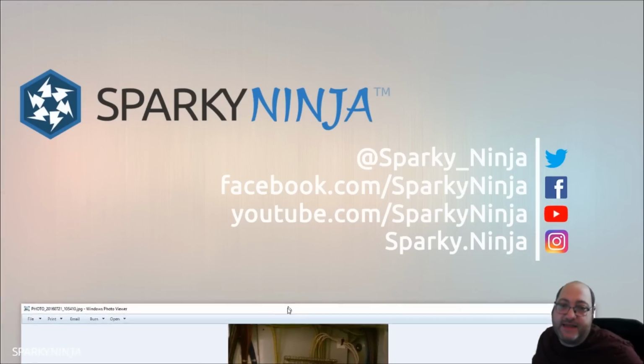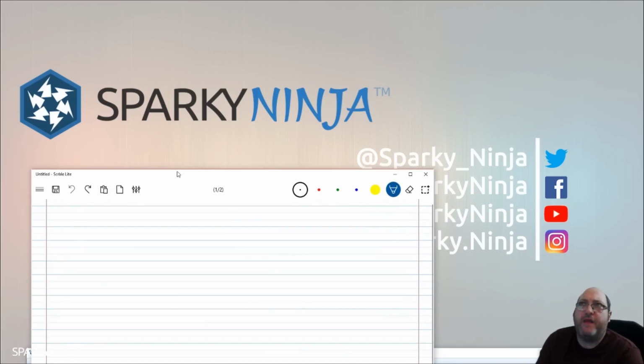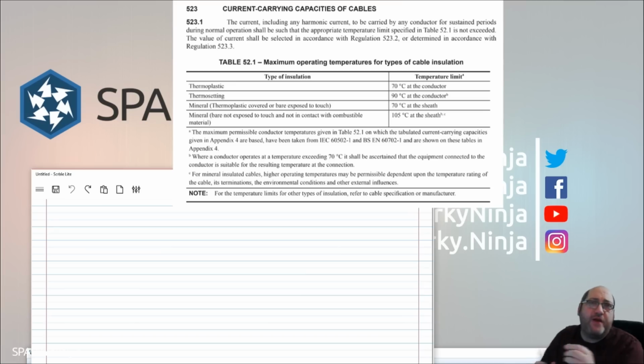Well, first thing we need to understand is the capacities for conductors. So if we were to assume that these cables were the standard off-the-shelf 70-degree thermoplastic, we need to remember that 70 degrees is the limit operating temperature for those conductors. We have a regulation that tells us this. Is it this one? Yep, 523.1. This tells us about the limiting temperature at the conductor for thermoplastic insulation, 70 degrees. So when we say a cable can carry X amount of current, what we're really saying is it can carry that current from a baseline to get to 70 degrees. The problem is, are there any other factors that adjust this?